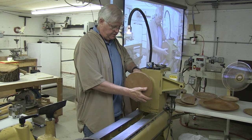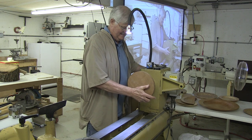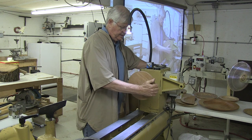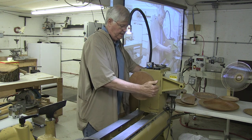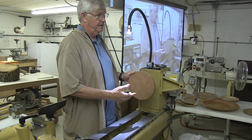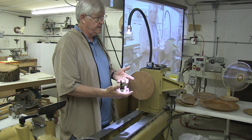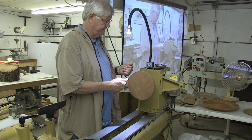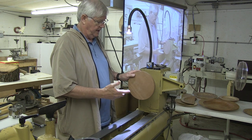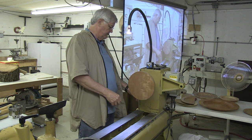The other alternative for these screw chucks is you can use the insert that's available on your four-jaw chuck. It's bigger than this, but it's a similar kind of screw. It's sharp, so it cuts instead of chewing the wood. It cuts in, and it holds fairly well.